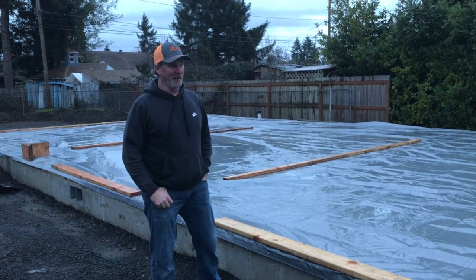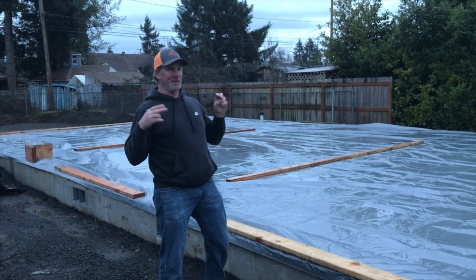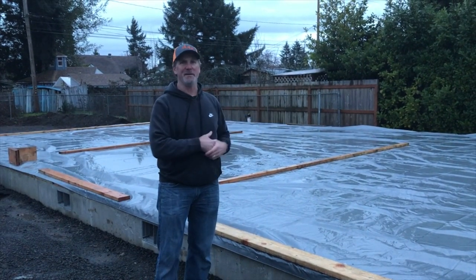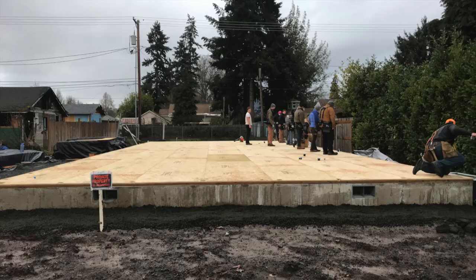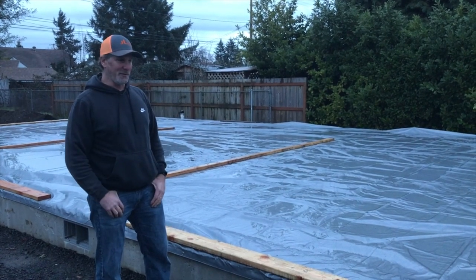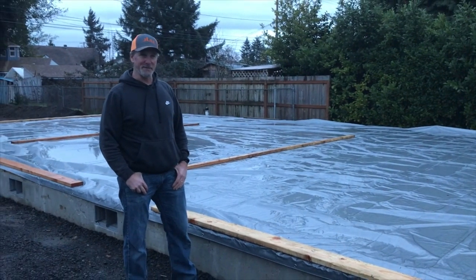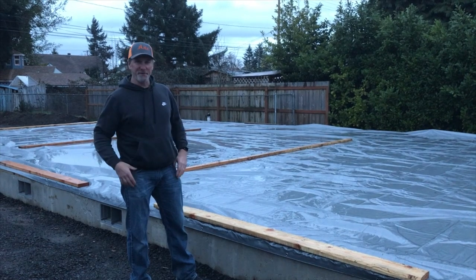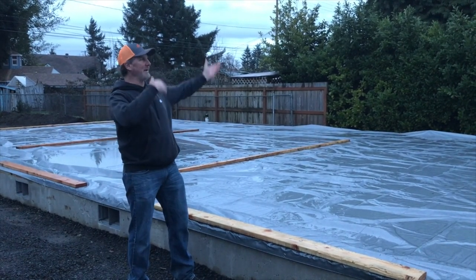Good morning again. Back at the job here in Springfield, the basically duplex building, we got the deck platform here sheeted, which means putting the plywood or subfloor on the top of the joists. I covered it with this tarp because we knew it would be a while and it rains here in Oregon, and I really don't want it getting any wetter than it needs to be. So we are back here today, again, the first stages of what it takes to frame the walls for the building. And step one obviously is going to be to get this tarp over there.